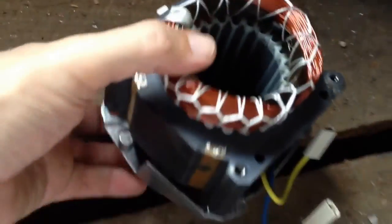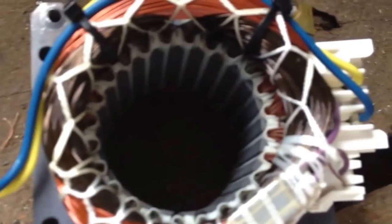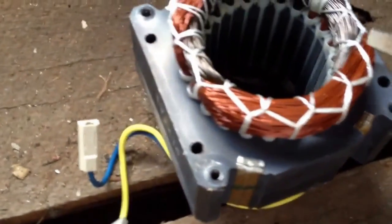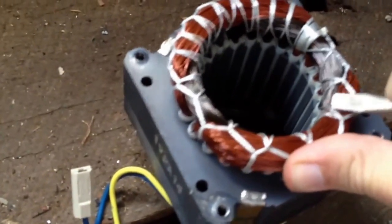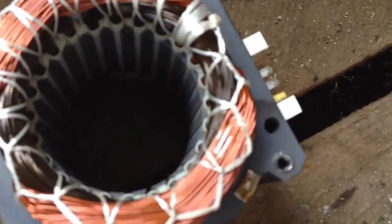Here's our motor again. Just take it, turn it over. We've already removed those four bolts — just take this top off and set it aside. And there's some good copper. We've already tested this and it is copper — it's not a coated aluminum; some of that stuff can wind up being that way. You can just take a screwdriver or something and scrape that. See how that's a nice bright copper color? That's what it's going to be on the inside.